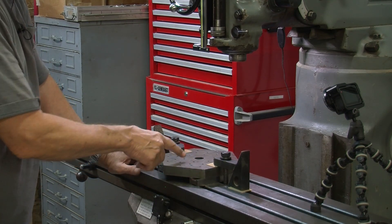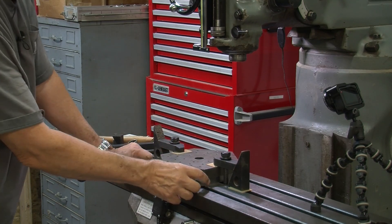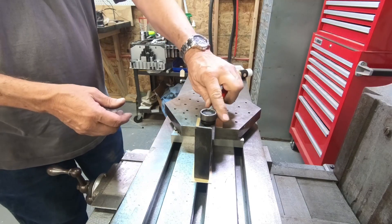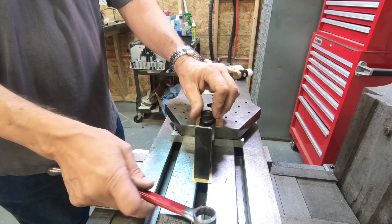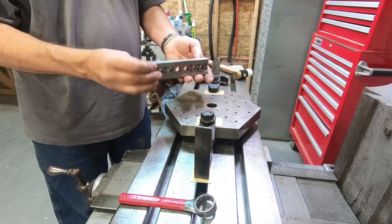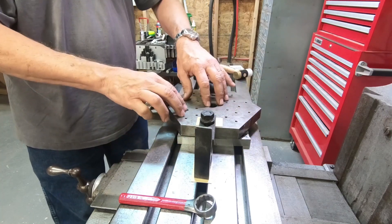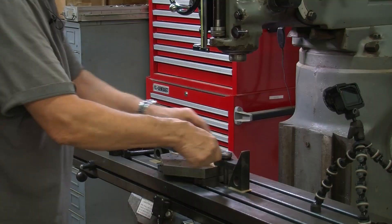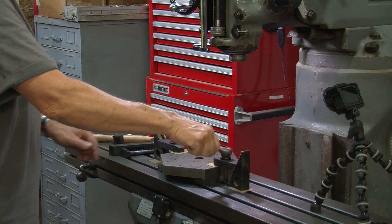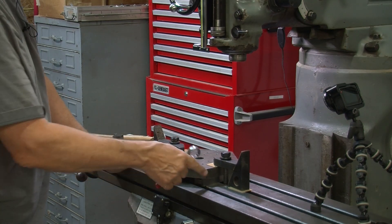On this particular setup, since perhaps I was going to drill a through hole, underneath the work piece I put parallels — large parallels — and in this case I laid them on their side. There's a large parallel and it stepped the work piece up off the table so that I could do things to it and drill holes through without worrying about damaging the table. Of course you have to keep in mind that the parallels are there too, so don't drill a hole through your parallel either.